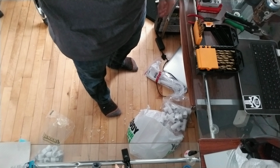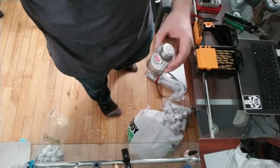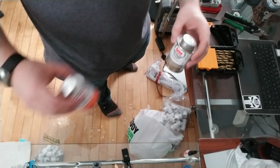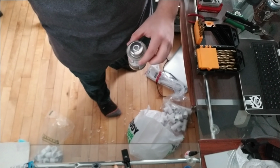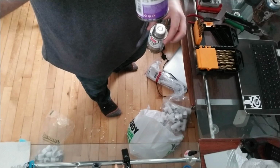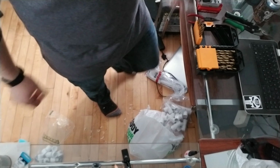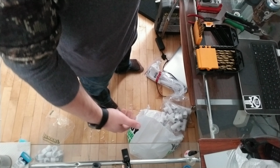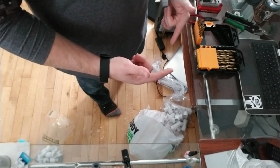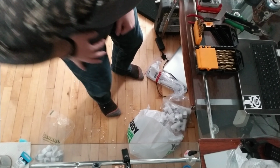And then now, let's see here, you're going to want some glue. There's a few things you're going to want to glue up. Note that CPVC uses a separate glue than regular PVC does. However, they can both use the same purple primer here. It'll be labeled on the jars, but it's just something worth noting. I believe that's it. So, as long as there's no questions, let's get started.